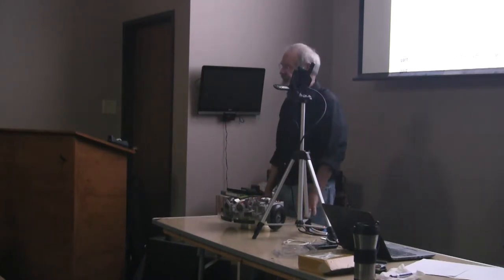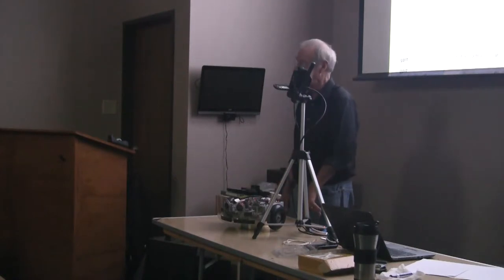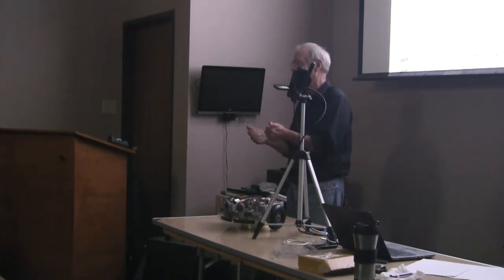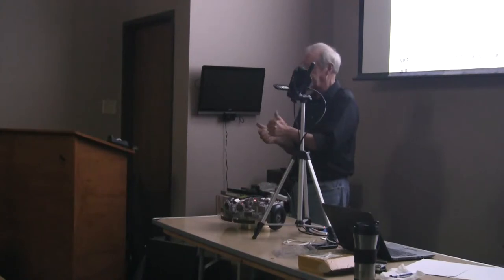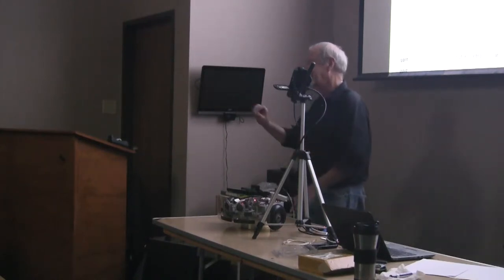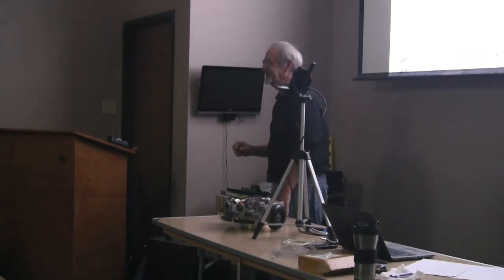Yeah, so again, that's the proportional, and that's how you change that, right? And this one is not really a PID controller, it's really a PD controller, so it's just proportional derivative. Basically you want to try to keep the proportion small so that it doesn't overshoot, and you can even use the derivative to dampen the behavior. But that's sort of like how much salt is enough. Everybody does it differently.